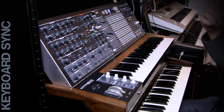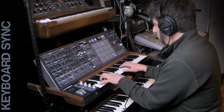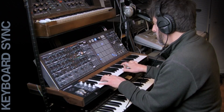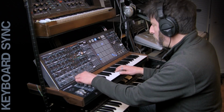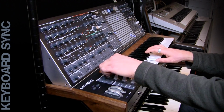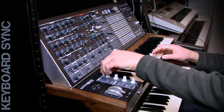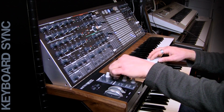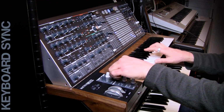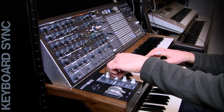Sounds like we have some velocity sliders going on there too, but it creates a really interesting timbre. And of course we have M1 stuff going on. M1 changes the VCO1's pitch, so you can also play with the sync effect there. M2 affects, what is it? VC, oh, the master cutoff. Rather subtly.